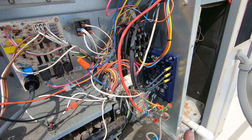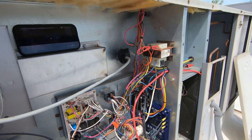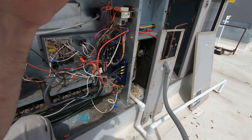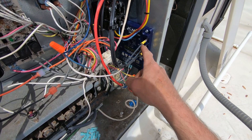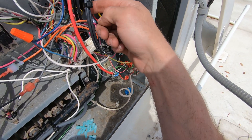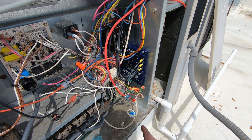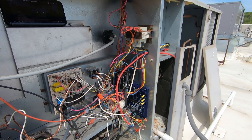So we're going to break R to the thermostat and that'll shut the unit off if we have any issues with the phasing or the voltage from the supply. I don't foresee there being any issues. They wanted the phase monitor as a precaution, just for the fact that it was missing a leg because of the breaker. I'm going to button up these panels, apply power, and set this up. I left the wires long enough that if I had to switch one — L1, L2, L3 — I can flop one. The control will tell you whether the phase is incorrect or not.